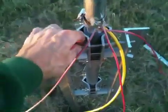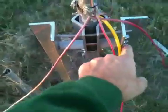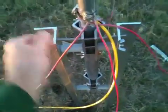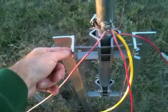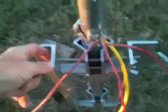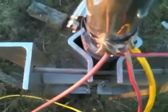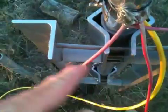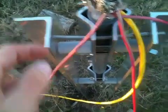This is the temporary bolt here that you slide through while you're disassembling this one here, if you want to tilt the thing over. So you slide that in, you take this out, and then you can tilt it over. But this is cheesy — because there was no wind blowing and my 32-foot pole was just waving a little bit, and you can see the bend in it. It bent this already, and I had to hit it with a hammer to straighten it out. So I'm going to have to go to Tractor Supply and find me a nice long lag bolt about the same size, and drill out the template spot here so I have a nice long bolt that goes through.